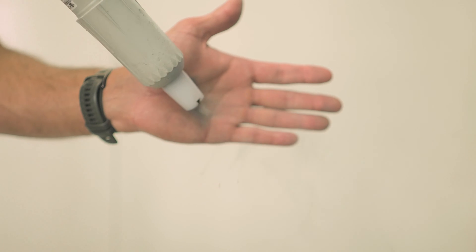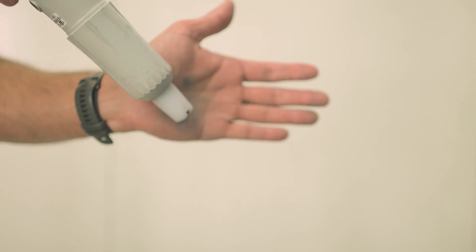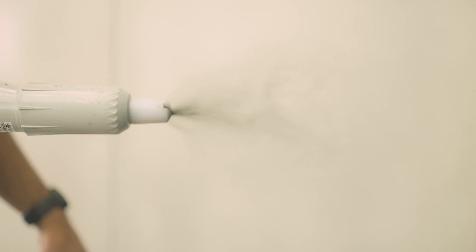Just make sure you're pointed away from your parts when you use it. If you don't have this option on your gun, you can simply tap the gun tip periodically and then pull the trigger away from your parts. This is going to knock loose any powder that has collected, and then you'll be clearing any clumps out while pointed away from your parts.